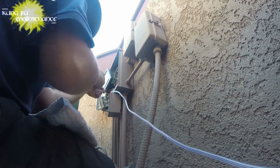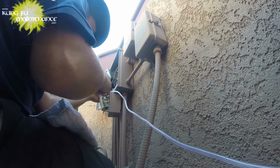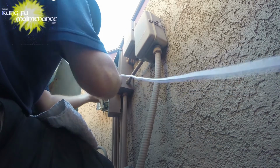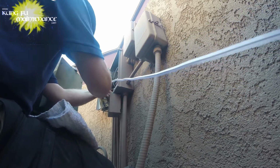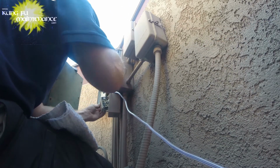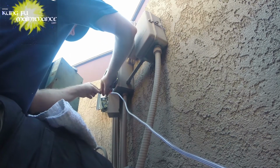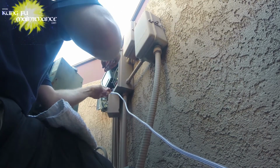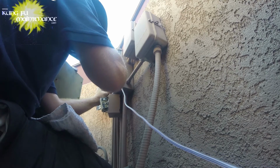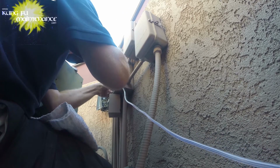So you could technically connect these here, or we could bring them up into here and connect them there. But this is our incoming hot wire. So it's going to need to go down and into the box. There's not much room. So that's always fun, right? These two can come out, or we can connect them here. Make sure I have enough room here. So, feeding the red hot, initial hot wire down into the box.